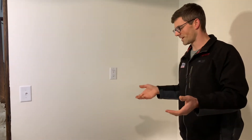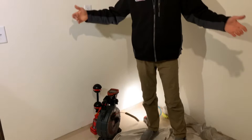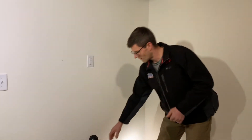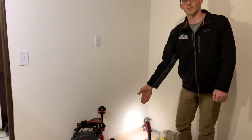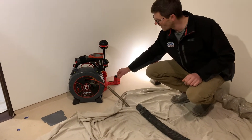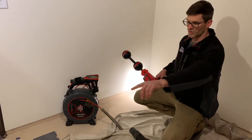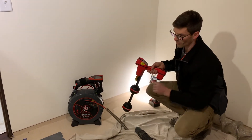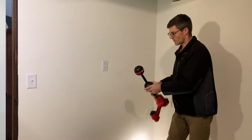I racked my brain thinking about how to get next to plumbing. I dug all the way over and didn't find it. I talked to a plumber — he said they've got to be there, they want to run under the footing. So I did some research and pulled the trigger on a micro reel — a sewer camera. The cool thing is it's got a transmitter in the head. I put it down the plumbing clean out for the floor drain and was able to trace exactly where it runs. This is the sewer pipe below the slab and it tells me how deep it is — no more guessing.